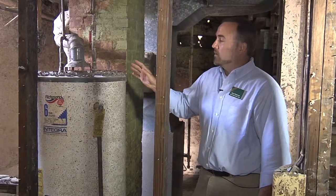The one thing to absolutely remember is, no matter what, if you rebuild, you want to let it dry out as much as possible, and also not put untreated wood up against that cold foundation wall. That moisture can come through the foundation or from inside, and that wood up against the wall — if it's not treated — it's going to mold and mildew and you're going to have problems. What I can do is take rigid insulation and put it against that solid wall, and that doesn't have the same moisture issues. The ideal situation is to insulate on the outside.